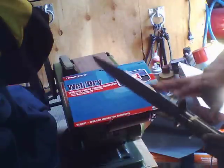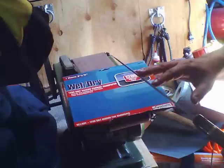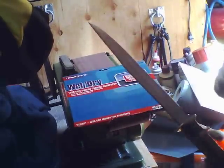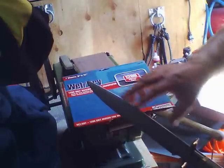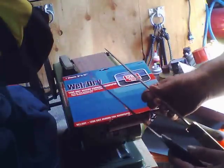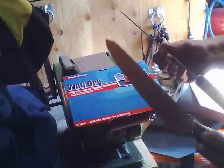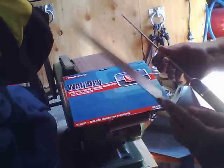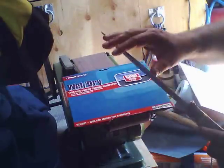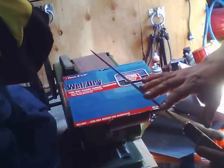Now, I designed this as a survival knife mainly for processing game and as a fighting knife. I did not make this as a wood chopper. I will not cut firewood with this knife, okay? I designed it with a thinner blade that would be a little bit closer to the profile of a kitchen knife. Again, because I've tried using big, thick survival knives in the kitchen. Didn't get as far with them. You can't do the precision cuts on vegetables and stuff like that with a thick blade. You can do it with a thin blade.